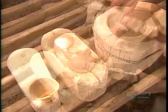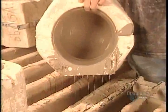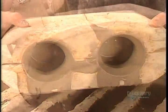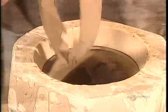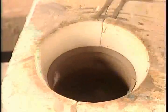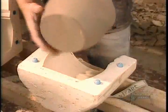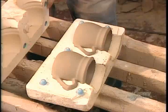The plaster mold slowly absorbs the water, leaving behind a moist earthenware lining half a centimeter thick. After about a half hour, this lining hardens and they can dump out the surplus liquid. They cut off the excess earthenware at the top. Then after another 45 minutes or so, they extract the piece from the mold. Workers have to handle the earthenware gingerly with even pressure — if one finger presses just a bit too hard, it'll show up as a dent, but only after the piece is fired.